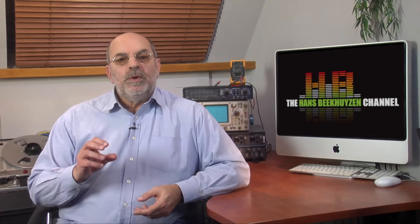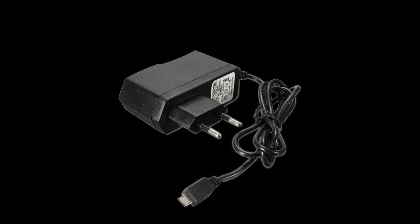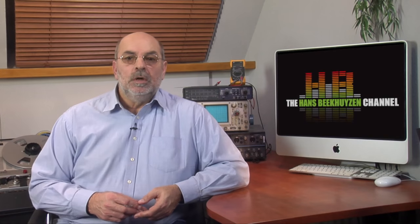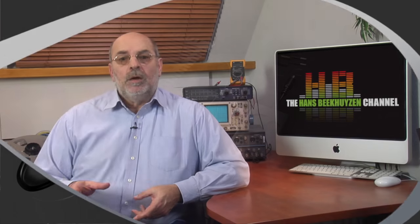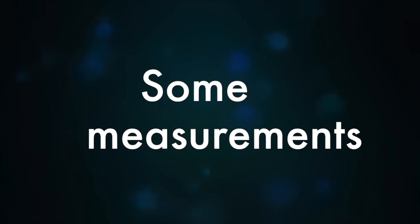The Raspberry Pi with the El Cheapo switching power supply suffered from poor signal-to-noise ratio of the power supply so badly the Jitterbug couldn't help out. When the power supply was replaced by the costly but very clean S-Booster Best of Two Worlds power supply, the power lines cleaned up and the Jitterbug could provide a further improvement.